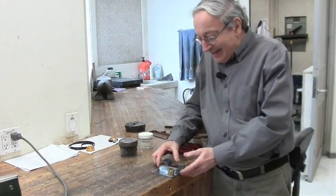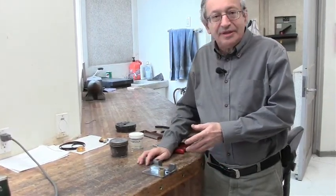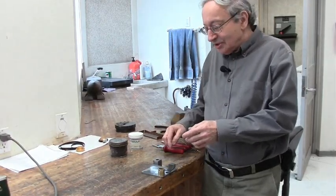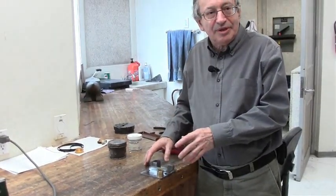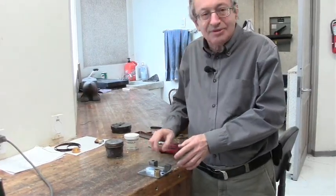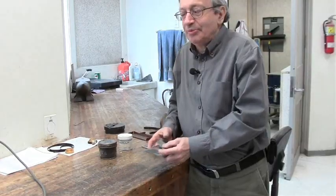Another way you can do it is tack things in place. I usually do it with a laser welder, which is a little bit exotic, but you can just put a dowel pin or anything. So let's tack it in place with a laser welder and then prepare it for brazing — but the laser welder is really a luxury here; you don't have to do it. You can also spot weld it, but not the brass. So let's just tack things in place where we want them.